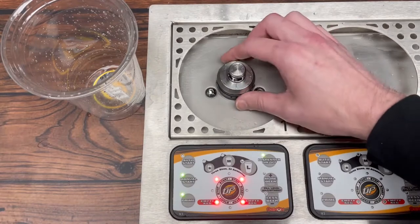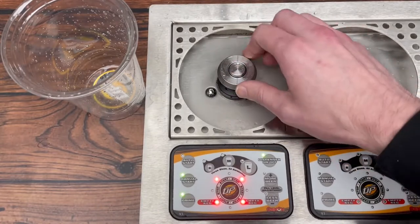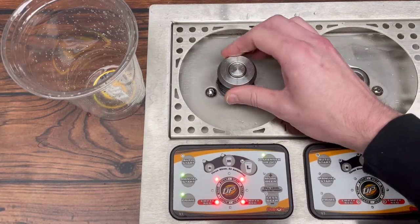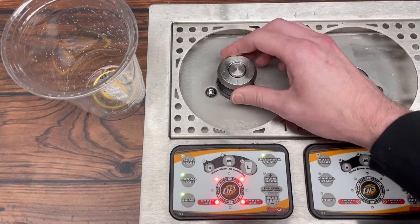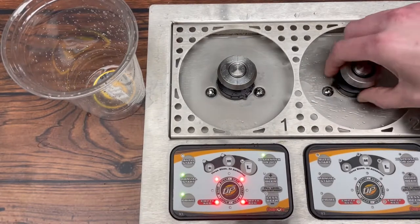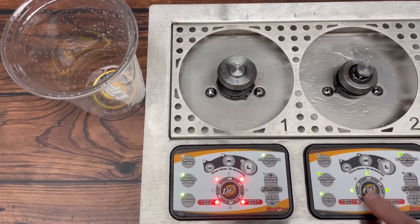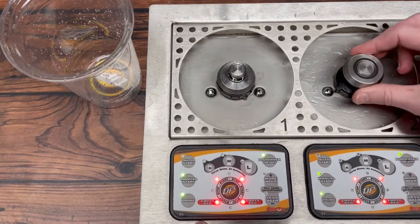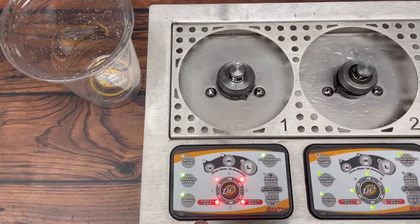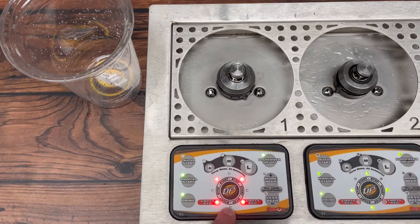So we'll just spin this magnet a little bit. We're rotating the slider piece here on the cup coupler — it's a magnet — and sometimes it helps just to rotate it and push down. We should be getting four green lights in this area. Instead, we're still getting red lights. So it's not a slider magnet issue. It could also be a slider magnet issue combined with a cup issue, but this is going to be a cup sensor issue more than anything.